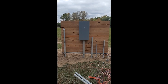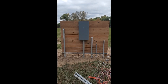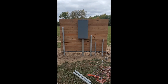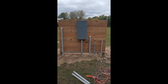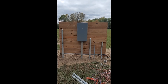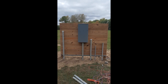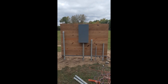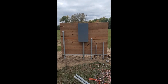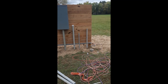This is our combiner panel for our inverters. I brought a full 200 amps out here due to the fact it is 350 feet from the electrical service on the building. After voltage drop calculations and so on, it basically resulted in 200 amp wire coming out here — 175 amp wire would have been enough, however it is very hard to find at this moment. There will be two 7.7 kW inverters on this system, one on each side of the panel. I did run a conduit out for data, internet, or ethernet.